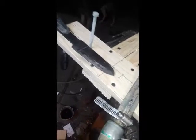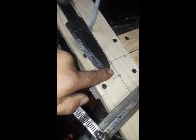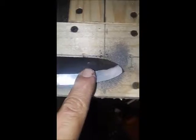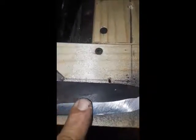After about five minutes of filing, you can clearly see how uneven my bevel is when I did it by hand — but that's okay because we're fixing it with file work. After about 20 minutes of filing, I've got a clear indication of where my bevel lines are on the knife. Sanding it before doing your bevels just saves you a step of having to mark it with a marker. I've still got quite a ways to go — there's still quite a bit of beef on this knife.